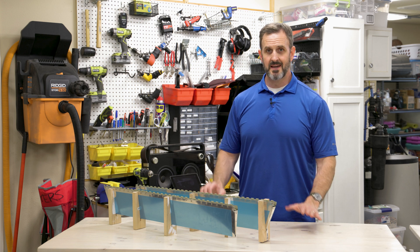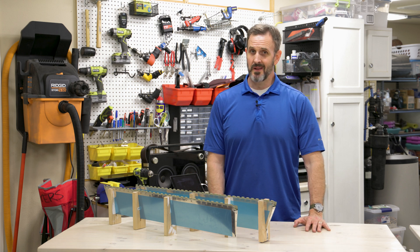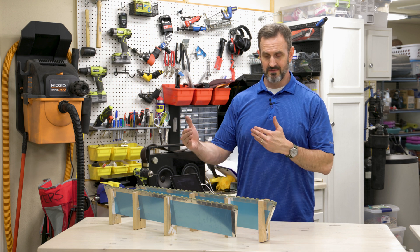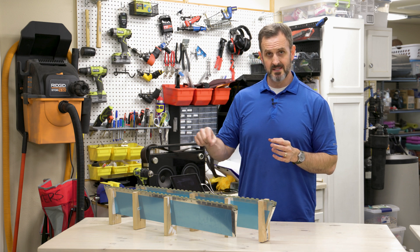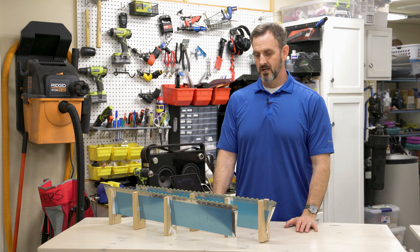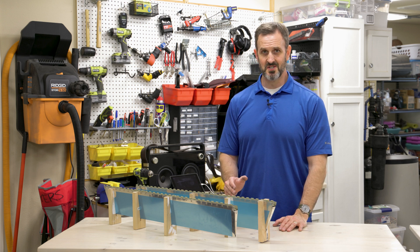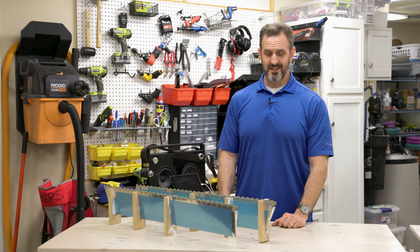I just finished the final assembly of my trim tabs. I had some video filmed with audio, then realized after they were completed that while I pressed record on the video camera, I didn't press record on my audio recorder - I have to do both. So I have a whole bunch of speaking segments with no sound. What you're going to see for this next portion of the video is basically me putting some tank sealant on these foam ribs, shoving those foam ribs inside the trim tabs, closing them up, putting them in jigs, and then riveting the top of the spar to the skin. The instructions say not to do that and to wait until the tank sealant's cured - I got impatient and did it anyway.